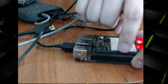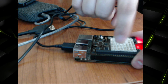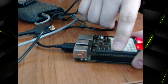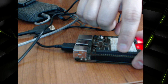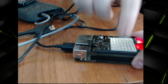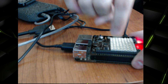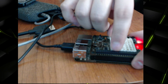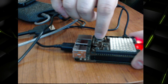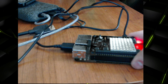You can actually, there are some videos on YouTube, you can watch them. The SenseHat does not use all the pins over here, it only uses some few limited pins, so you do have access to other pins. You can potentially take some of these out. You will damage your SenseHat if you don't do it properly. Word of caution over there. But if you would like to do that, you can watch some of the videos. You can still access many of these Raspberry Pi pins for your other projects if you want to add SenseHat and still want to have the flexibility of having those pins available to you.